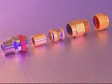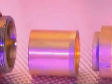The 711 cable gland comprises five major components: these being the back nut, middle nut, armour grounding device, brass pot, and entry component complete with red deluge seal.